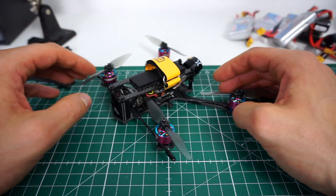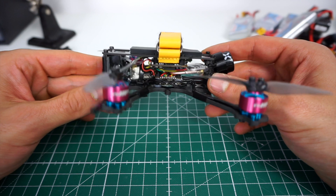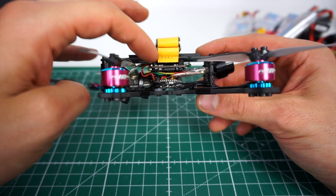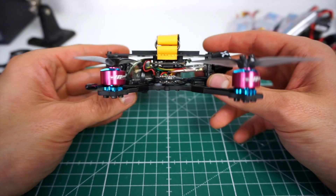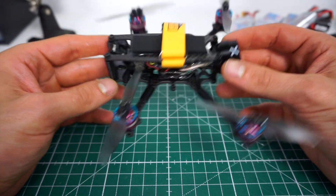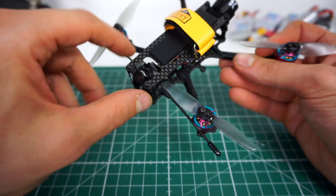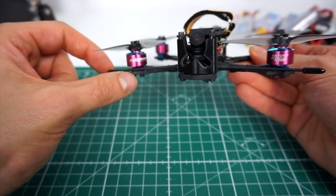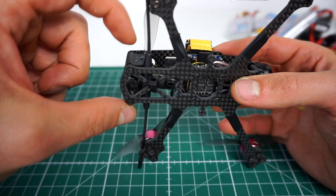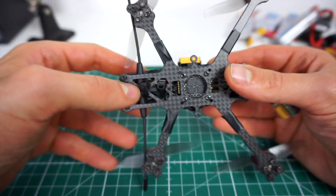On my build, a few slight updates. I first started this build with 20 millimeter M2 standoffs — now these are 23 millimeters — just because I wanted to have a little bit more separation between these boards and the VTX to avoid everything getting too hot. I also added the new TPU parts that I uploaded to Thingiverse. I have the new big chunky cam mount which should avoid the slight jello I had in my footage. I could still place the Crossfire right behind the TPU cam mount, just zip-tied here — it won't touch the motors too much, but that should be fine.